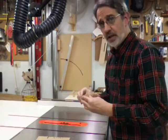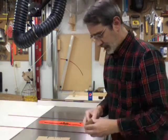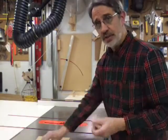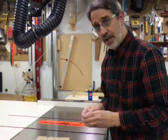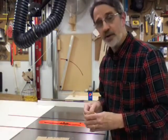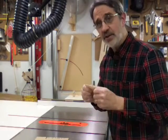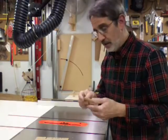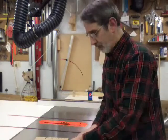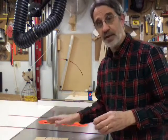You don't want to use what they call lexan. I've never used that for this — it's a very hard type of plexiglass. I use it at work for making machine guards because you can cut it to shape, take it to a sheet metal shop, put it in a large brake, and bend it 90 degrees or even tighter without it cracking. Regular plexiglass would just shatter. It's really nice stuff but not cheap. At home, I'm going to use plain plexiglass.